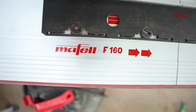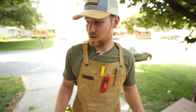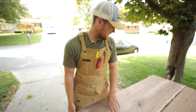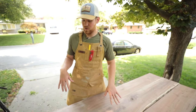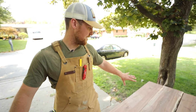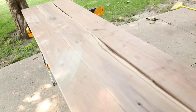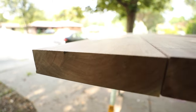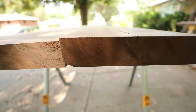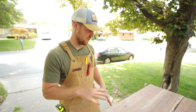All of them were over 10 feet. Got the Mafell saw here, which I'll get into more. These are some of the boards that have already been cut, just gonna create a really nice edge. When you do a plank table like this with these long pieces that are somewhat thin, they do tend to warp a little bit before you join the table. With the help of a biscuit joiner, that'll help me line up all the pieces and then I'll work on just leveling it all out.